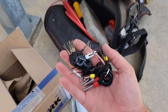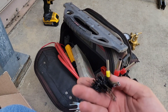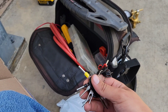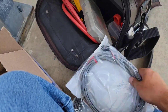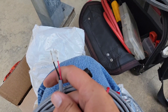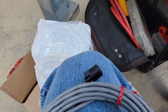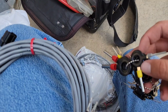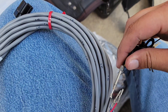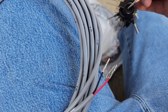A tool that is a must-have is this electronics pin tool. This is specifically built to go into these pins here. Let's get this opened up. You have these little tiny pins — these are what go into that little Molex connector. We're going to find which one of these fits over that. That's probably that one. Yeah, that's going to be the one. We're going to use that gray one.